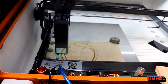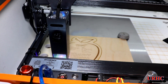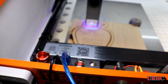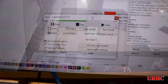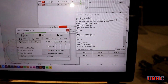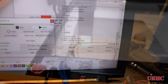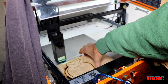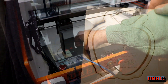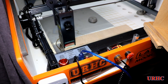Everything would lock up — the machine would lock up and I kept getting an error notice about GRBL in LightBurn. The machine would just lock up and you had to reset everything and restart it. I wound up redoing that three times — it would run for a couple of inches and then lock up. The machine still thought it was running. After it stopped I think about four or five times, I just gave up on it. After starting up again it started making a sooty result.